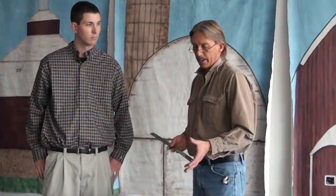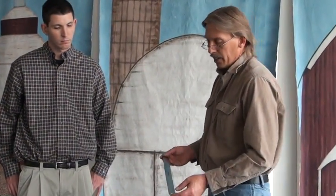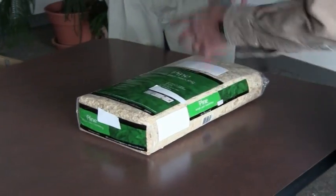Handbook 130 requires that animal bedding have both the compressed and the usable volume on the label. We're going to follow the peat moss procedure from Handbook 133 to measure the compressed package. So we're going to take an average of 3 measurements of the length.